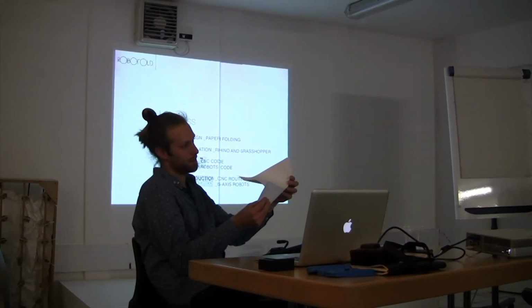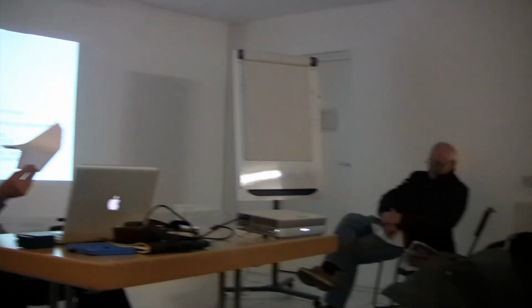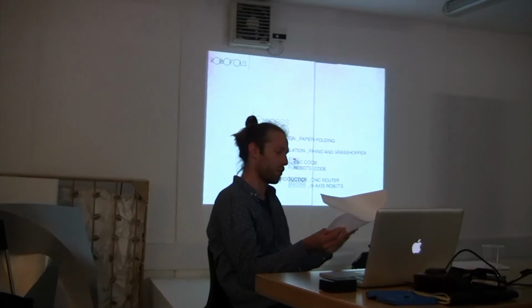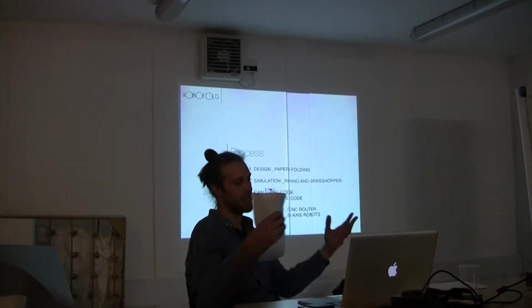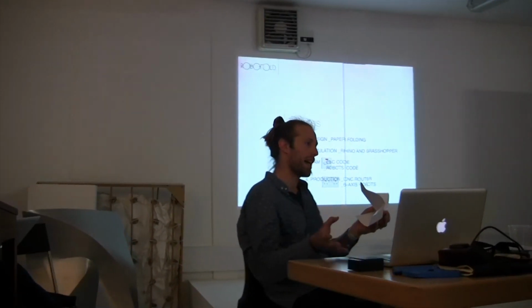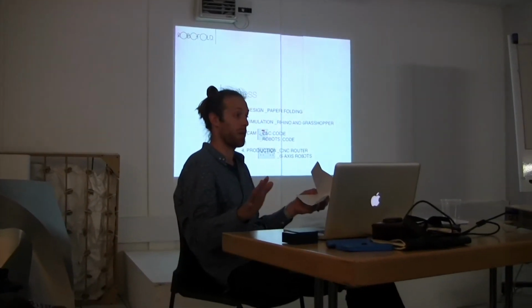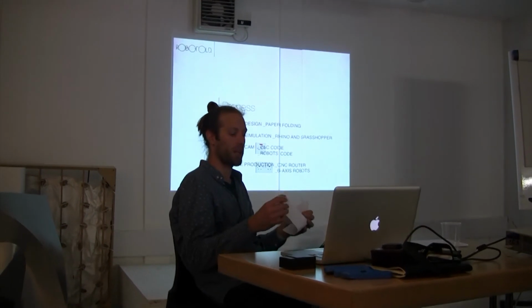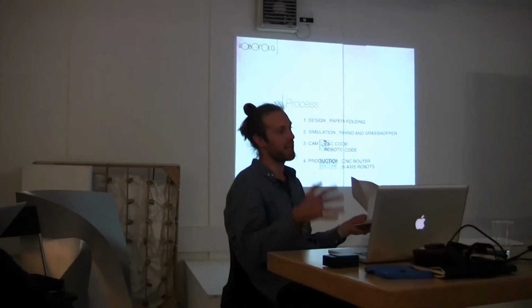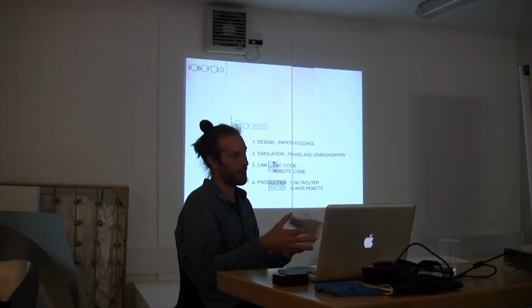So you model the physical characteristics. Yeah, we model those physical characteristics. It's steel, so it's not just... Yeah, exactly. It's a dynamic model. A lot of the time we just take that directly from the paper model because it's so similar to the steel. Or if we want to be really accurate, we'll fold something in aluminium by hand and then analyse that surface and use that for the simulation, so we're as close as we can possibly be, which is quite an empirical way to do it, and it would be great, again, to embed all of that in software in good time.